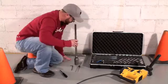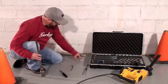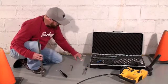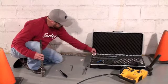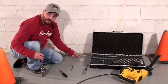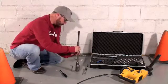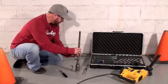The purpose of this bit — as we've already bored a hole here — is to bore this quarter-inch deep ring, which is for the tamper-resistant cap so that it fits flush with the floor when you're finished. So basically you'll bore down a quarter of an inch with this bit.